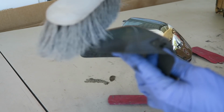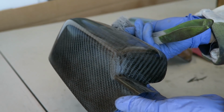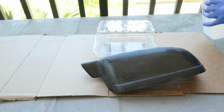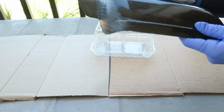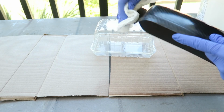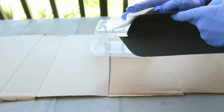When you have pinholes in there, of course you have to be really careful not to leave any sanding dust in those pinholes, because then that will just get bonded in with the sealer and it will look much worse than the pinholes did before you sanded. So I cleaned it out really well under running water with an old toothbrush to get into any pockets that might be in there, and then right before spraying the sealer, I cleaned it off with alcohol to remove any final residue or fingerprints.